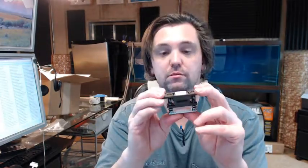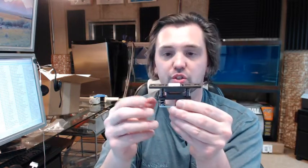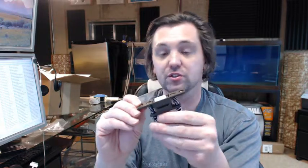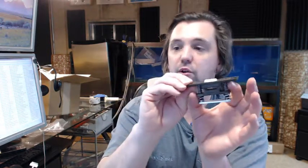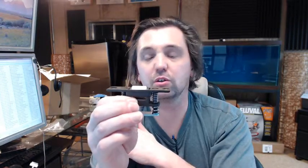Machining for this is broken down into two steps. You've got the body preparation and then you've got the plate preparation. If you think of it in those terms, you have a two-step operation where you're first going to mortise for the body of the unit itself. Don Joe's template does not give dimensions for machining — it gives actual physical technical dimensions for the item itself. So if your dimension is 1.6 inches per the template, that's just over 1 and 9/16 inches — you're going to want to pad that depth by about a sixteenth of an inch and you'd be in good shape.